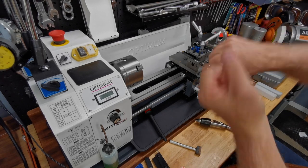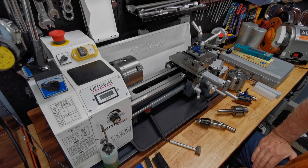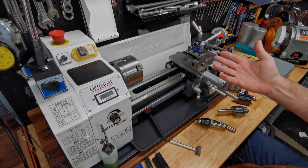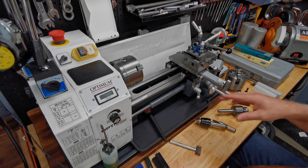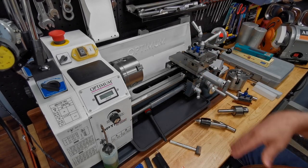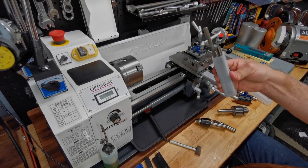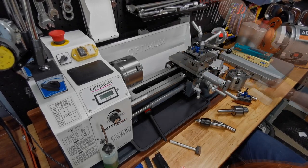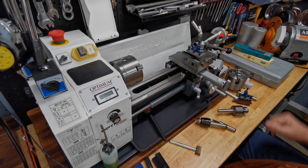The alternative you'll keep seeing are adjustable reamers with a mechanism where the blades can be pushed in and out. I nearly made the mistake of getting those — they're for hand reaming, not for this purpose. At some point I'll probably get a set because if you've drilled a 10mm hole and just want to clean it up you can use one of those.